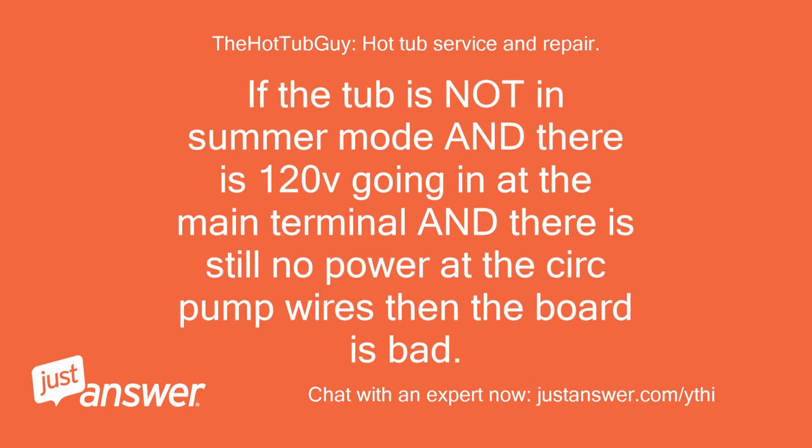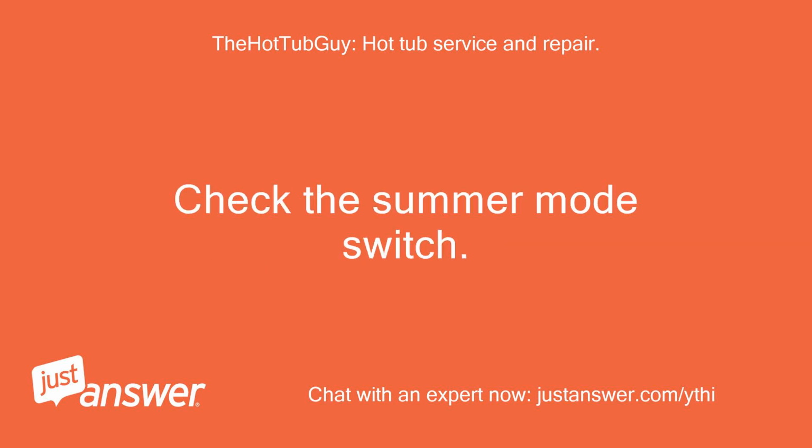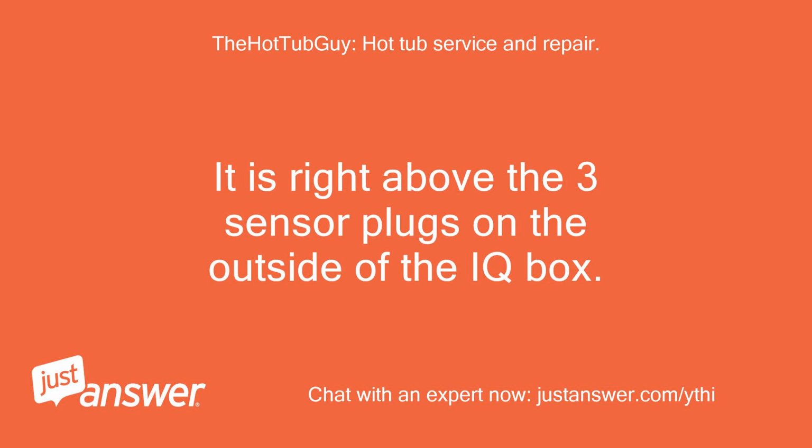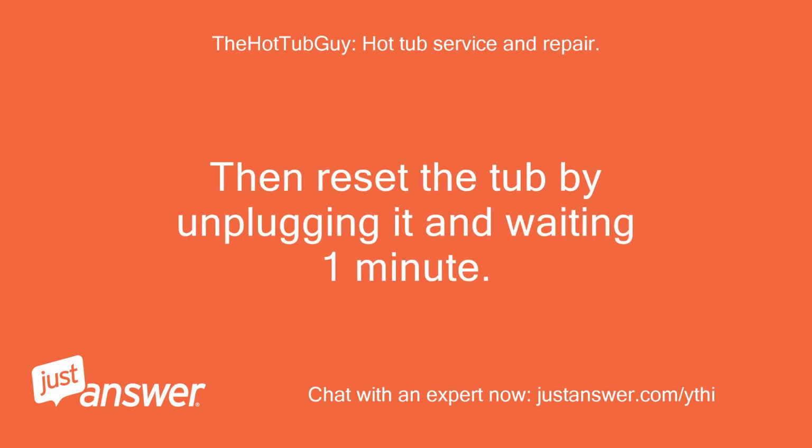If the tub is not in summer mode and there is 120V going in at the main terminal and there is still no power at the circ pump wires, then the board is bad. I still don't know if you are using a flow switch. Check the summer mode switch. It is right above the 3 sensor plugs on the outside of the IQ box. The switch must be up. Then reset the tub by unplugging it and waiting 1 minute.